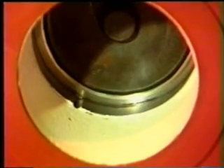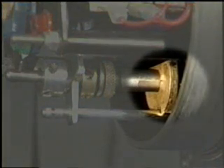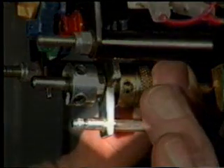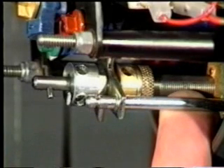First, we'll set the limit for valve closed. Turn the actuator hand wheel manually until the valve is closed — close it firmly. Turning the screwed shaft anti-clockwise, bring the traveling nut hard up against its backstop. Gripping the screwed shaft between your thumb and forefinger, continue to turn it, using the over-travel guide for leverage if you need to. Bring the over-travel guide up to the overrun stop. During this final movement, you will have heard the switches click. Let's do that again and listen.